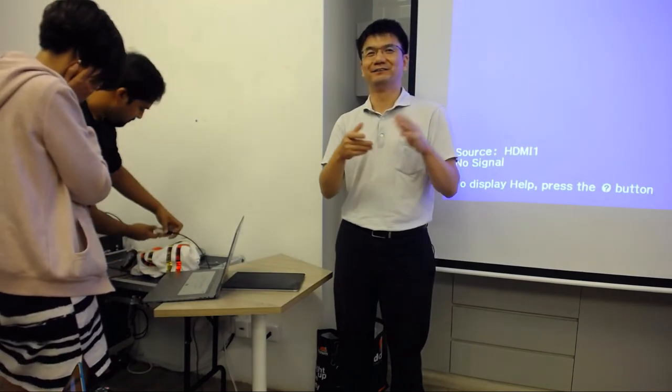What we're doing is we're not supplying it at 3.3. The specification says 5 volts. That's the problem. So actually, I did some testing. I lowered the voltage of the NeoPixels. It actually works until like 2.7-volt. But at this kind of voltage, the color is not very nice. The green color is very bright, but all other colors fade a lot.